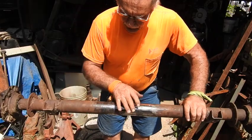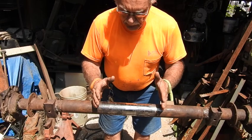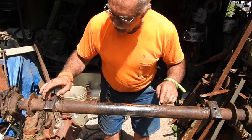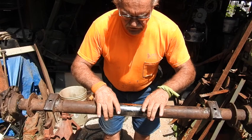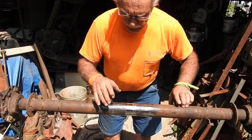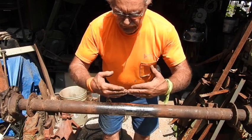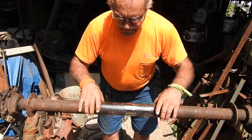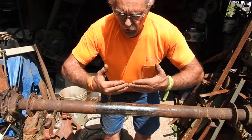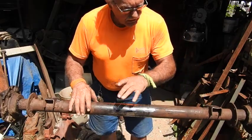Now, if you take a look at this — it's not perfect, not by any stretch of the imagination. But remember the six buttonholes I drilled into here? I stuffed that inch-and-a-half piece of pipe in, centered it up, and welded those buttonholes shut with the pipe clamp on, pulling this through to my groove. You can see my groove marking the very top of the axle. I welded those together so that the heat isn't going to warp the axle, with it welded in those six places. Prior to doing that, I held everything square and true and tacked three tack marks roughly 120 degrees apart to hold the plane as it needed to be. Then welded those six, then went about welding a portion at a time, peening it, and letting it cool in between to minimize the chance of overheating and causing it to warp. It's still fairly hot right now, but it doesn't look too awfully bad.